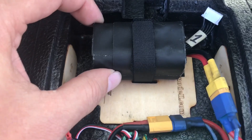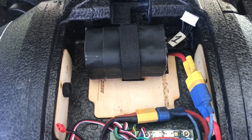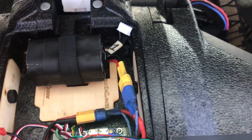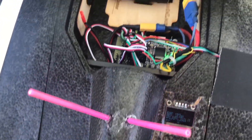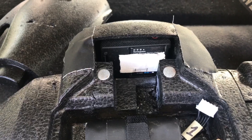In here I have the GPS and compass, also from Matek — awesome products. For the battery, I have a 4S DIY self-made battery with 3000mAh cells. With the stock ESC and this motor and propeller, it gives me about an hour of flight.